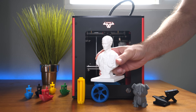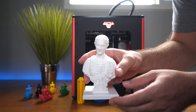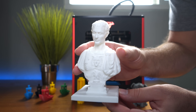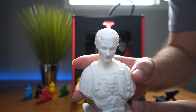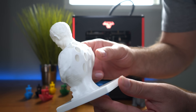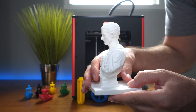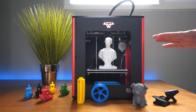The next part is a larger print — a Roman statue-style pencil holder. I had to scale it down a little because this printer's max height is 140mm; this model came out around 130–135mm tall, close to the limit. It turned out amazing — just look at his face and his hair. The bottom warped just a little bit, probably because I didn't use enough glue on such a large area and the corners lifted slightly, but it's still an excellent print overall.